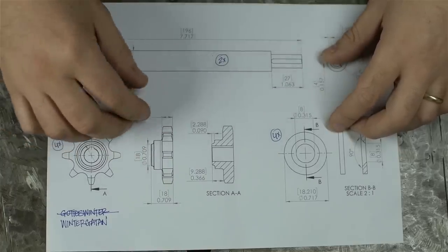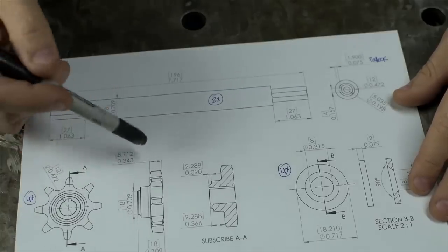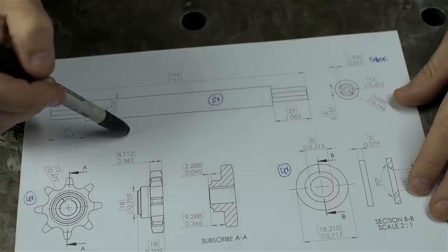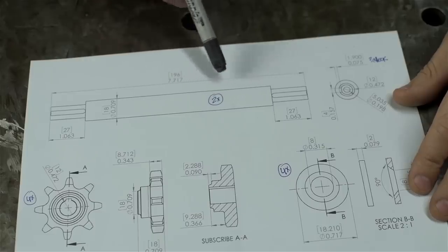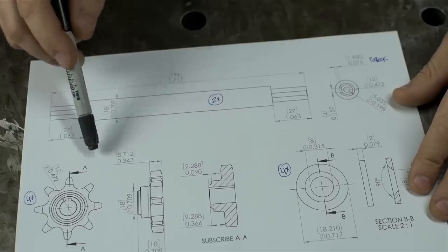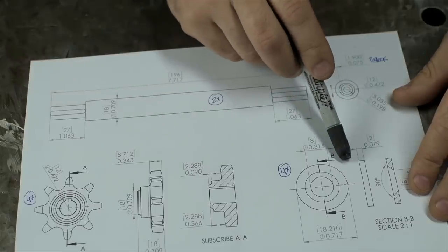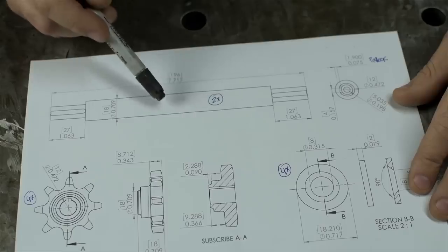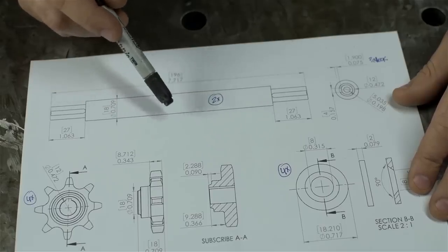He's not paying me to ask questions. In fact, he's not paying me at all. Let's look at the drawing. There is frankly not much here mechanically, though that is one of the hallmarks of good mechanical design. Nonetheless, I'll do my best to make a mountain out of a molehill. There are two identical shafts, each built up with two keyed clutch bearings and two keyed chain sprockets. The clutch bearings and the sprockets are off-the-shelf parts. The sprockets just need to be sized, bored, and keyed. Along with this, there's a custom countersink washer and M6 screws that keeps the whole thing together. This is two identical assemblies.